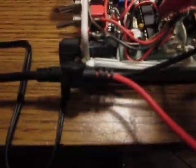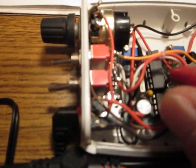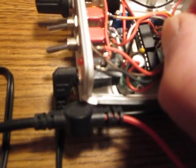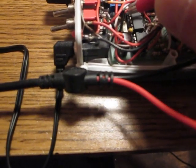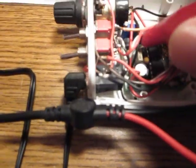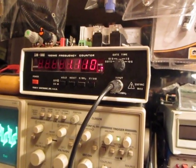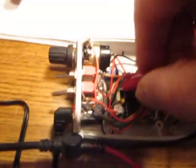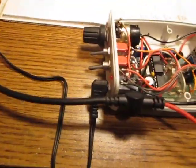Now if I switch to the output, that's a 2.2 kilo ohm resistor, the one which goes to 3 signal diodes and further to the transformer. Now if I can reach the resistor on the other side, which is 22K, okay, I should read 1110, and that's what we have. So the frequencies are okay, and so I can take them off,